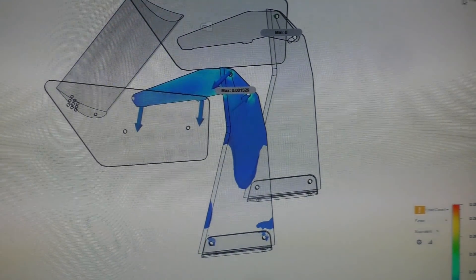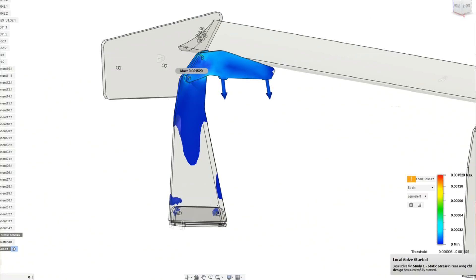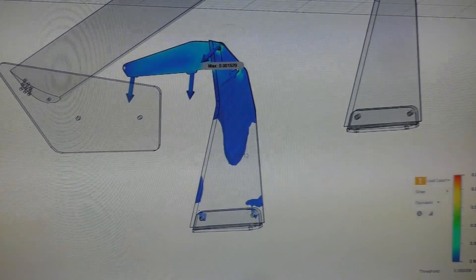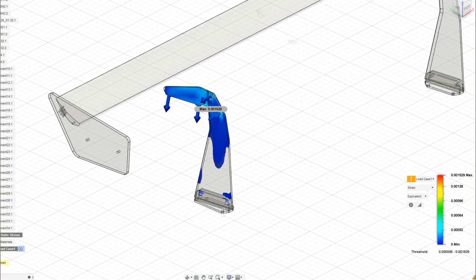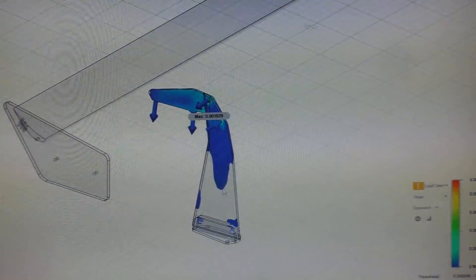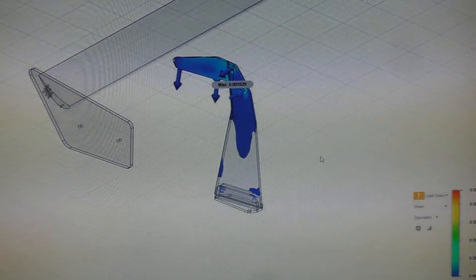Here's a look at the simulation results behind the wings, making sure it's actually strong enough to withstand the downforce it's going to be making. I could have made the supports more efficient and taken some weight out, but drilling pockets and taking weight out would have disturbed the airflow underneath the wing — that's why we just left it as a whole solid piece on this one. But of course on later wings that is going to be something completely customizable. We can't change these supports since they're billet aluminum and they're machined. So those are the results — now let's get into actually making the wing.